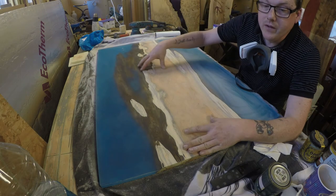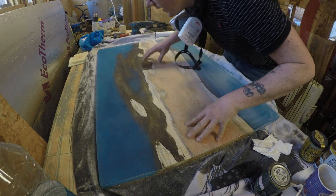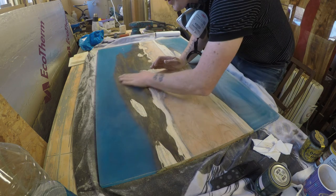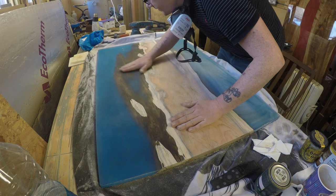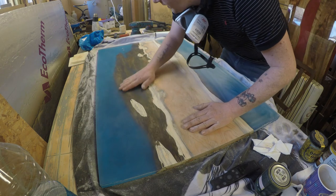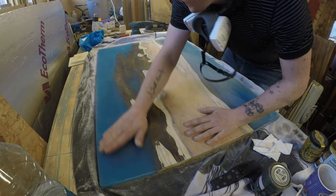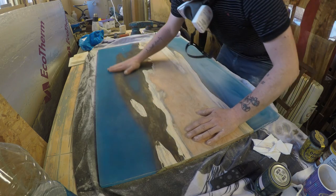As you can now see, we've gone over the whole piece and got a nice even look to it. What we need to do is wipe every now and again just to see if we've got all the scratches out. Sanding through the grits is essentially putting tinier, smaller scratches in to get rid of the big ones. Checking to see where you need to sand more will just come with experience. I can see we've got a little bit here and a little bit there that we'll go over again, but when we do we need to go over the whole piece again to avoid staying in one place too long and making it uneven.